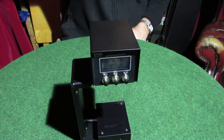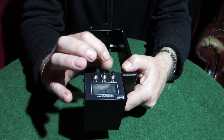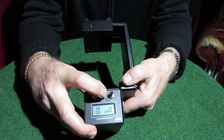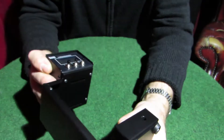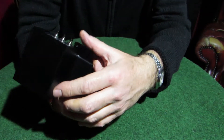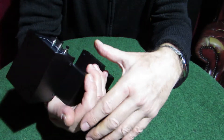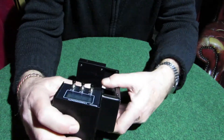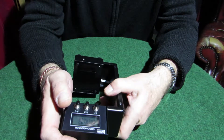The biggest thing I had a problem with was the memory — I couldn't suss it out for a while, but I think I've got it now. Once you've got all your readings and you want to save them, press S2 three times. You'll get a screen saying 'V average.' Press S1 and you'll get a memory function screen pop up — it does disappear pretty quickly. You've got R, W, and CL, and the memo shows 250, which is how many memory slots you've got left. I'm now going to show you how to save: press S2 three times, press S1, then press S2 for W (which is write), then S3 to get back. Now they should be saved.